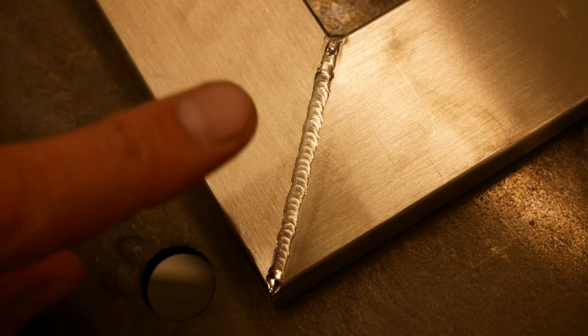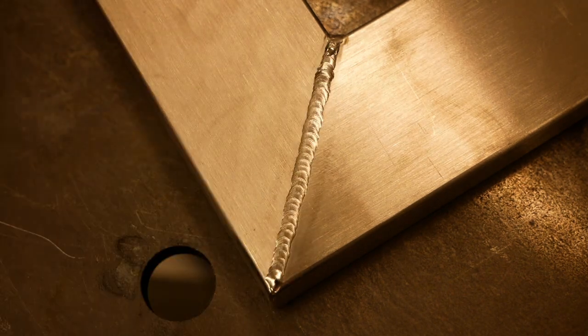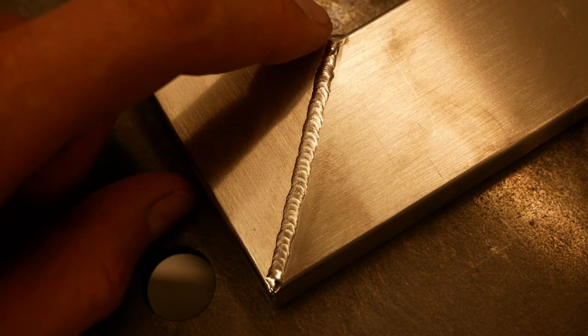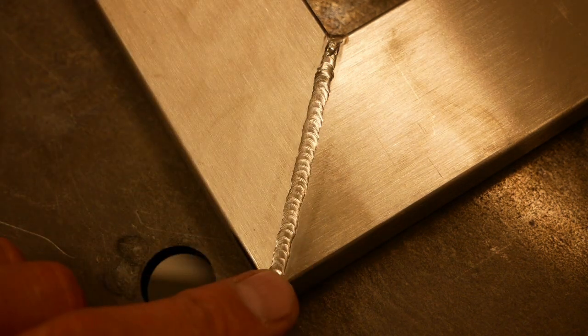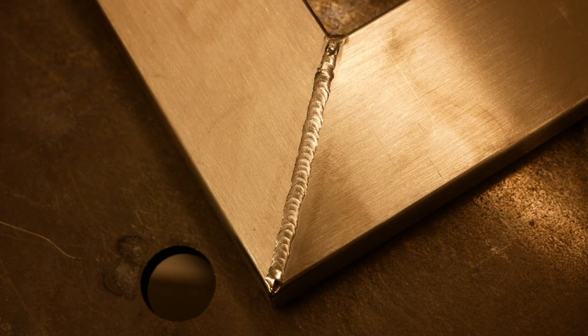As you can see, the electrochemical etching works like a charm. It looks like new. So you don't need to buy an expensive more than €1,000 kit. Get yourself an old beefy power supply, some phosphoric acid and a carbon brush, and then it's easy peasy. The weld looks really nice, not bad for an amateur welder. So quite happy with that.